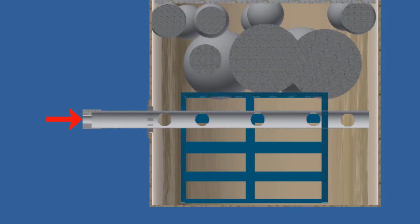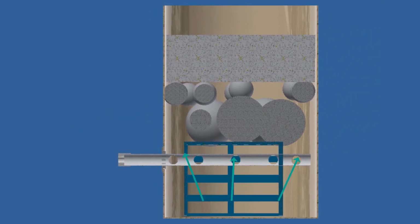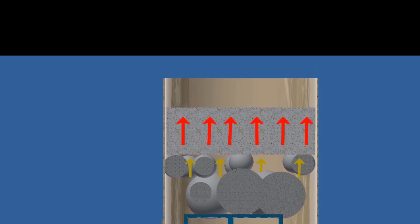So as the water comes in, the volume increases, causing the water to slow down. The increase in volume again causes the water to slow down again, and the heavier particulates fall to the bottom. Any of your smaller particulates will try to work their way up through the different layers of gravel. As the rocks get smaller, the smaller particulates get caught up in those rocks.